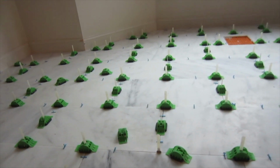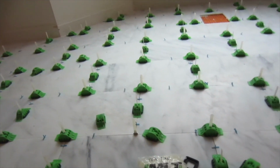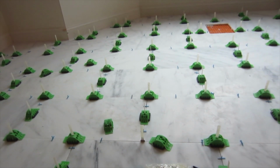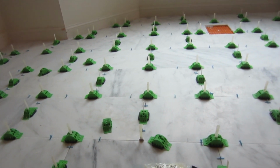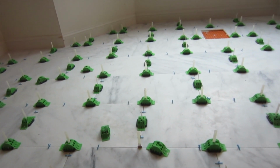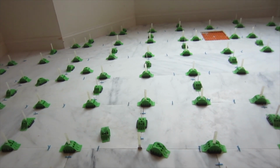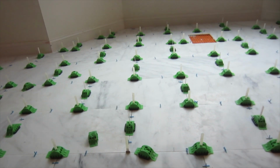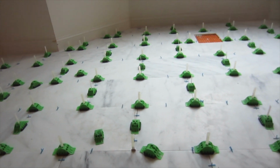And just a word about leveling systems. Leveling systems are meant to tune the lippage, and it's not to correct uneven or wavy floors. If you've got a really wavy floor or bad floor, it's not going to help, because that's not what these systems are made for. That's any system, not just the MLT system.